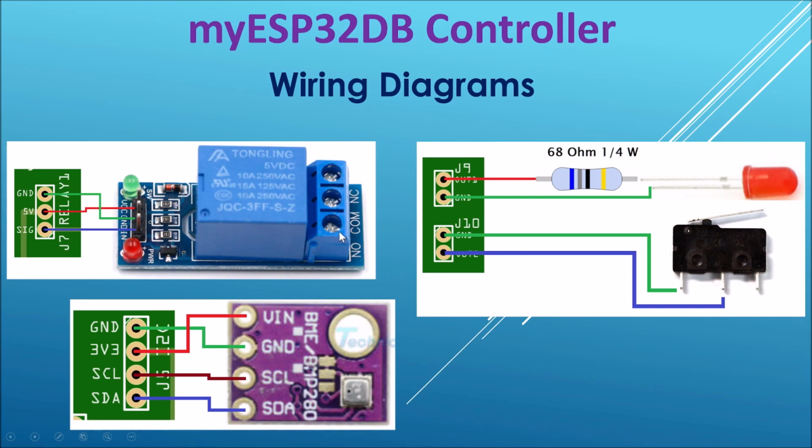We use normally open, so any device would be connected between COM and NO, because that's normally open. That's what NO stands for, normally open. And when we activate, the relay turns on and closes the connection between NO and COM, and that triggers whatever device is out there. If we didn't do it that way and we used NC, what you'd find is the moment you turn the device on, these outputs would be connected together and would trigger whatever device it was connected to, and that's a bad thing. So that's why NO is used.